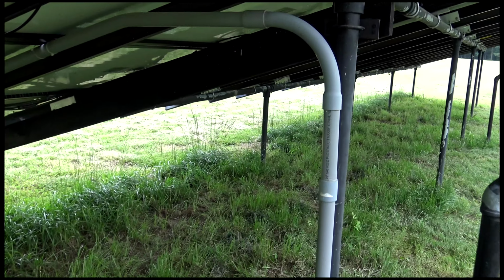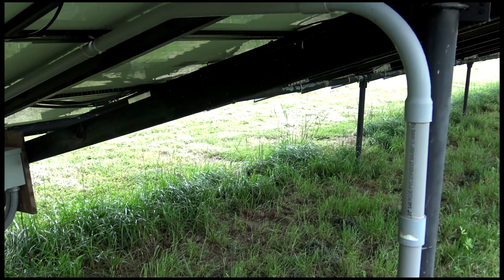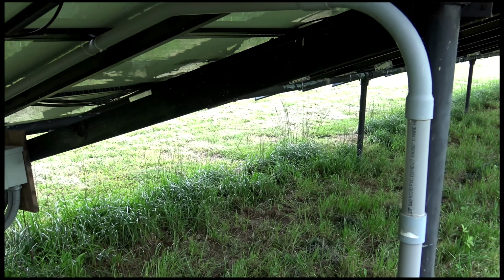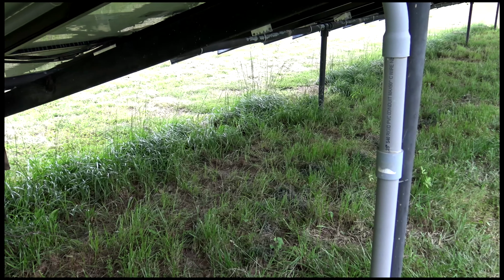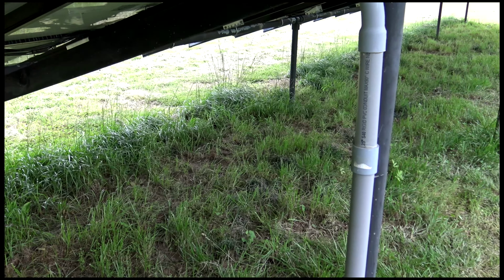Here's a major change. When I was originally doing this, I envisioned putting the inverters out here. So, coming across the field is where we trenched in the service cable. That was 3 2-gauge aluminum wires and a 4-gauge aluminum wire, and those come up through here. So the plan was that I was gonna take my DC wires, hang up the 2 inverters here, generate 240 volts off each of those inverters, and then pump it back into this service wire.